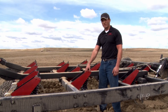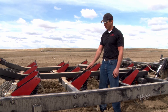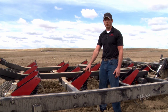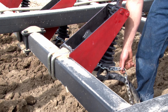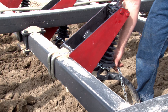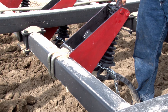The next part of the machine is the chisel shanks. What I use is a flexi-coil 650 foot-pound trip, and I use those because they're reliable and they're off-the-shelf parts — you can get them about anywhere. What we also do is we weld a chain to the point and we use a simple nut to hold that point on there. In case the bolts break, it's a simple two bolts and you're back and going.